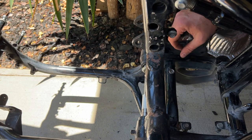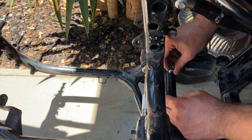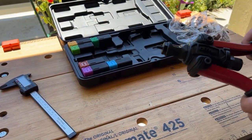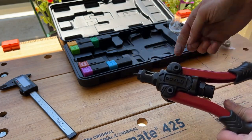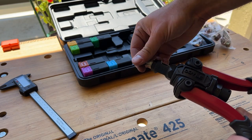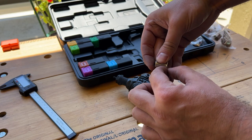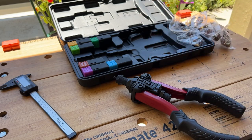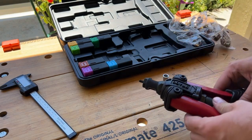Now that we've drilled, I'm going to use rivet nuts — the hole is a little bit bigger for that. What it does is put a rivet completely in place, and with the rivet nut setter gun it presses down so it stays. What we have here is a rivet nut setter — you have the rivet nut open, and by pressing down this way it presses the rivet completely together so it stays in the hole. Then you just have your bolt — and that avoids having a hole going through the entire tube, which I personally prefer, and it stays in place much easier.